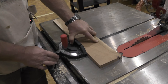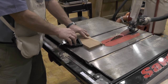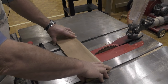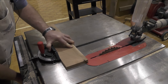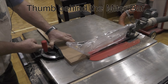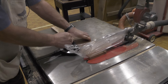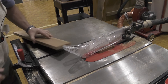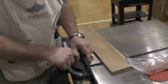We'll demonstrate a cross cut, then do a miter cut. Position it where you want it, tighten the miter bar up, and gently feed it into the blade. Never freehand cut any piece of wood on a table saw — that would be a freehand cut, and the chance of injury is very high; it's going to come back and hit the operator. Here's a demonstration — we're going to cut this knot right off. Put the blade down, put the guard down, turn it on. Hold the tool firmly — my thumb is behind the miter bar, my fingers are pulling the wood into the miter bar, and nothing is hanging out to get cut. Go all the way through the tool, bring the piece back — it gives us a really nice cut, 90 degrees relative to this surface.